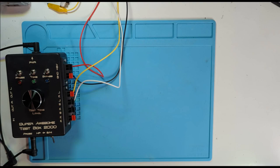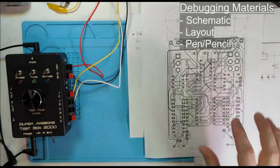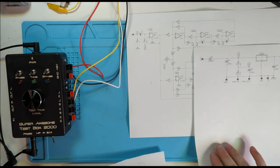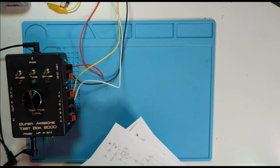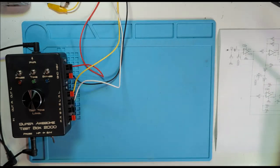Now that we've talked about equipment, there are a couple of other things we really need for a successful debugging session: a copy of our schematic and a copy of our layout. I've blown the layout up huge so I can easily look at the printout and correlate it with my circuit board and schematic. You need these so you can reference what the circuit is intended to be versus what you're actually getting. Make sure you've got a pen or pencil because we're going to be writing notes on these printouts.